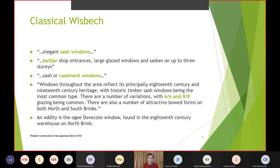The variations mentioned are six-over-six or eight-over-eight, referring to the number of smaller panes each window is made up of. Those numbers aren't necessarily the same — in later windows you got two-over-one. From a practical point of view, glass was very hard to produce in large panes, so having more panes in sash window design actually made more economic sense — the glazing was very expensive, and the bigger the panes, the more expensive that might be.